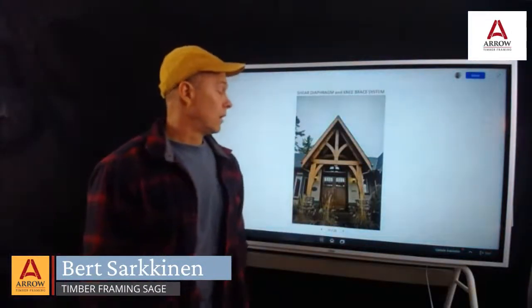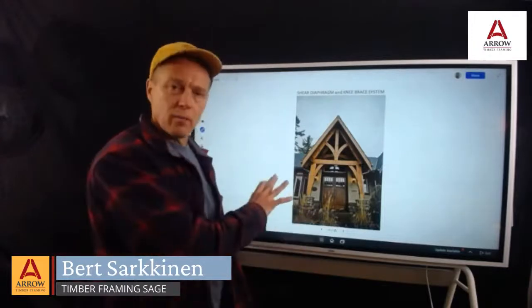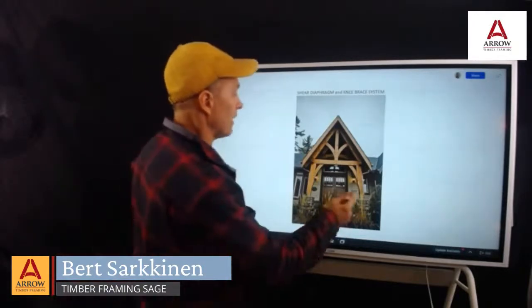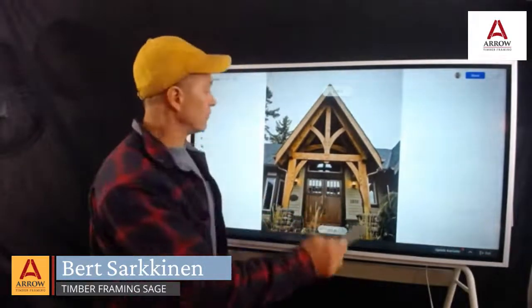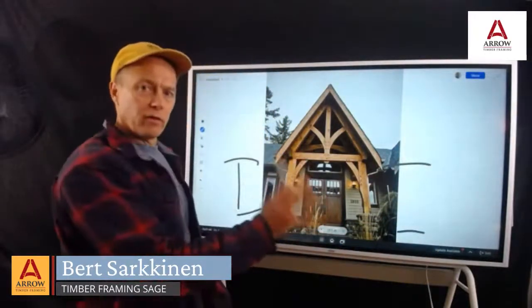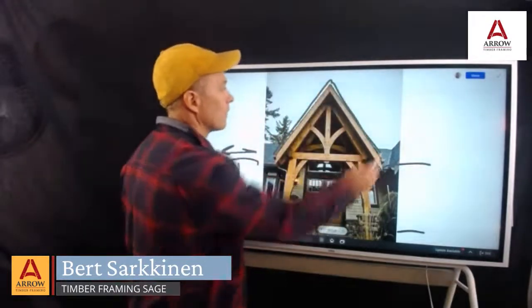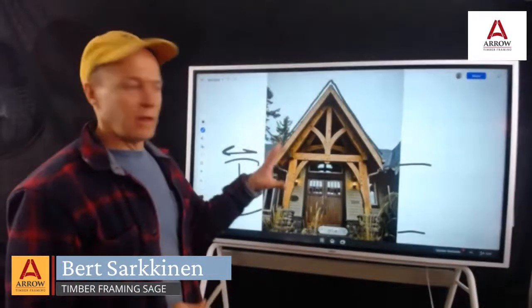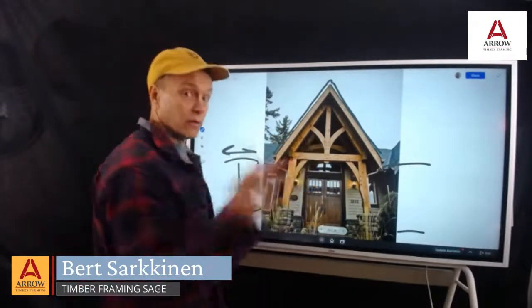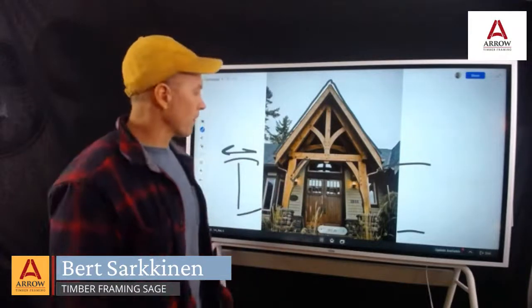Shear diaphragm. This is probably the method of choice for most engineers when they're talking about a timber entry and how to keep it from falling over. By far the easiest way to do it is to say that, okay, the body of the house or structure, commercial building, you've seen it in many applications, that is the body of the house. Just make sure the walls with all the plywood and the sheeting and all that have plenty of resistance, and just use the roof diaphragm, the plywood going back with enough nailing, and that's going to create rigidity and therefore nothing is going to fall over.